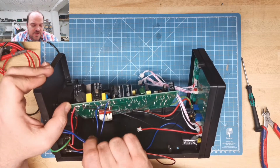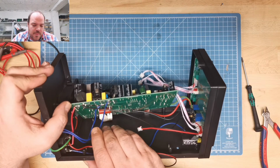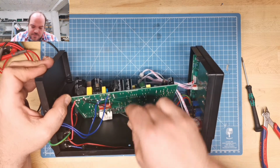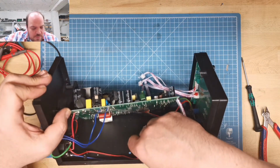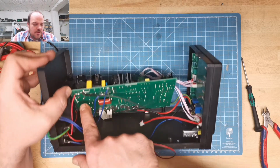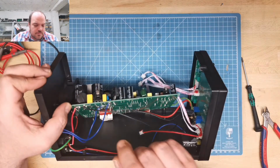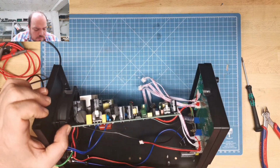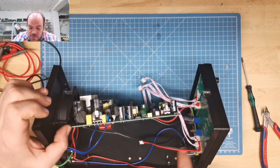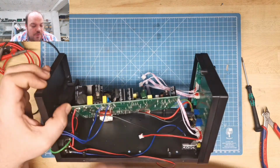And okay, this is just for switching between 110 and 230 or 240. And it's also very nice. This goes to the switch or comes from here. So input, okay, input voltage goes there. Then the second pin goes to the switch, from the switch back here. So these two posts here are for the input.